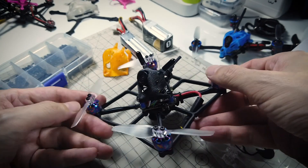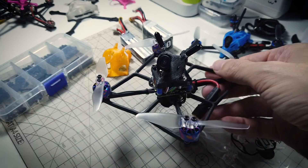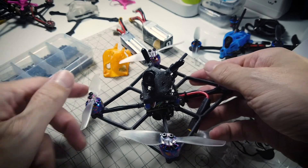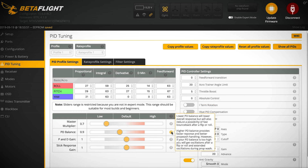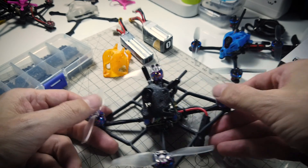For this one I decided to flash Betaflight 4.1. First I had to get the Betaflight Configurator 10.6 and then flashed it to Betaflight 4.1 because I wanted to check out the sliders — tuning the PIDs with the sliders — and that seemed to work out pretty well. It has all those great handy tooltips so it tells you more or less what everything does, which I think is a great advancement for Betaflight and tuning in general. The base tune I made up for this seemed to work well on 3S.